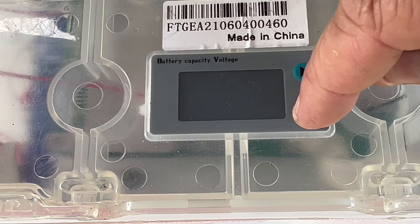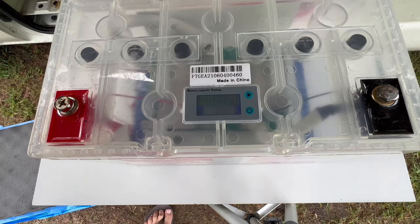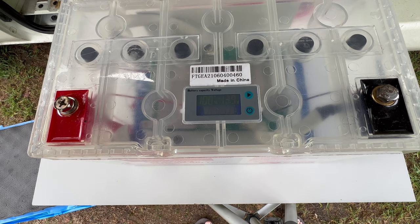You can see there's voltage there on the battery. There are one of five reasons why your BMS would go to sleep: either too high of a temperature, too low of a temperature, high in voltage or low in voltage being flat, or if you develop a short in your battery.